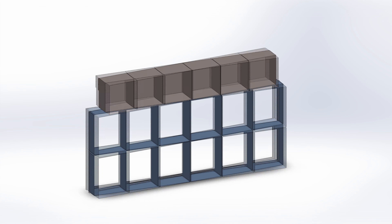I've designed this storage system to be as portable as possible for when I move into yet another space. But in the meantime, I might as well install the French cleat rail at such a height that this top surface is flush with the bookshelf surface, and everything lines up nicely. This measurement tells me where the rail needs to be installed to achieve a specific height for the top surface of the case. Instead of a second cleat down below, we'll use rubber bumpers — three-quarter inch long — on these holes.